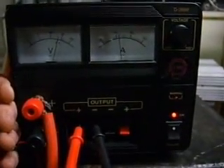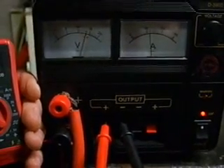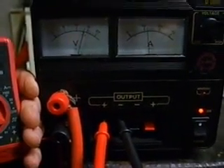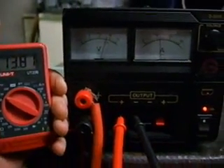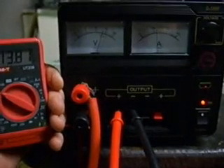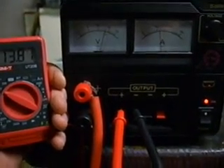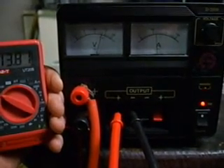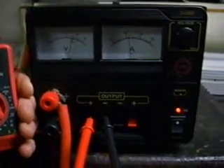This is capable of going up to 25 amps and the voltage is between 3 volts and 15 volts. I would have liked to have got one that went down to at least 2 volts, but there wasn't any. The only ones I could find that went that low only went up to 5 amps, and this unit was cheaper too — I got this for $150 Australian. It's got a cooling fan.